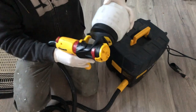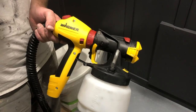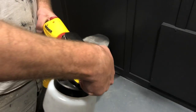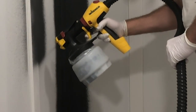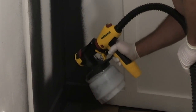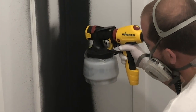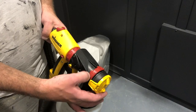At this point you'll want to reference the manual for the power and materials settings guide, but we'll also quickly go through all of the different settings and options. There are a lot of different ways to customize the spray of your paint sprayer. The first one is by adjusting the air cap, which allows you to give either a horizontal spray or a vertical spray. We used both options when spraying the board and batten — we used the horizontal spray when spraying up and down for maximum coverage, and switched to vertical spray when spraying sideways on the top rails.